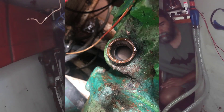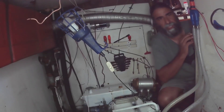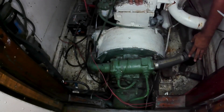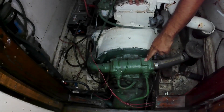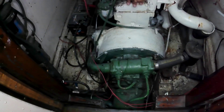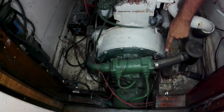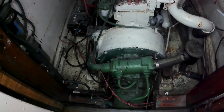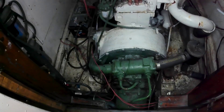There is another oil cooler just over there. For those familiar with gearboxes — this is the gearbox, this is the raw water in, and this is a cooler that cools the gearbox oil. This thing has clearly failed. So probably what I'm going to do short-term is bypass all of this. I've already flushed everything out and made sure not to allow that oil to sit there any longer. Now I have to move on to this project. I'm hoping it's something small like a seal and not that I need a whole new cooler.